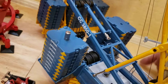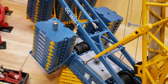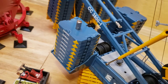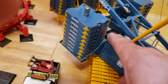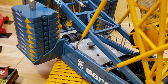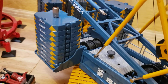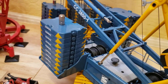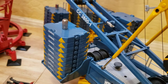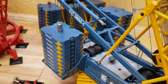When I finish reeving this side with the crossover, I stick the rope on the drum. Then I take the side that I have laying over here and put it on the drum — there's nothing on the drum at that point. As I start to roll it up, it is even. That's why this drum has an even amount on it — no difference in how much is on each one, so it pulls at the same rate. One drum with a lot of rope and one with a little is going to pull more on the one that has more — everybody knows that.